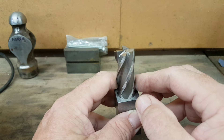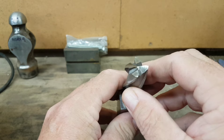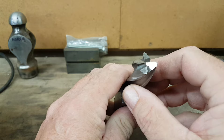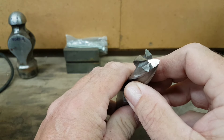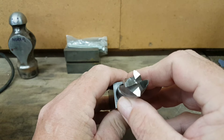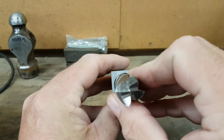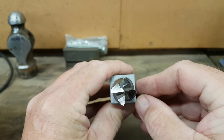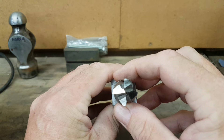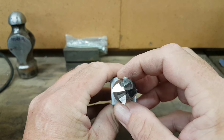For demonstration purposes I'm going to use this 20mm cutter which, to be honest, is completely knackered — it's had some severe damage done to it and you'd have to remove a massive amount of material from the face to get it back to four cutting faces. But it's been handy for messing around trying to set this up. This is the block with the end mill in, and the idea is you've got to set it so the cutting faces are running parallel to each one of the other faces.